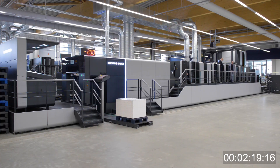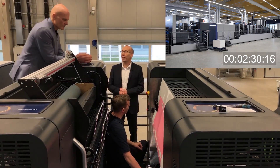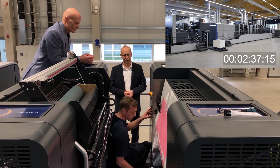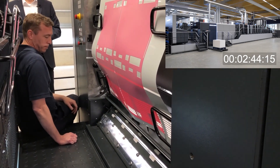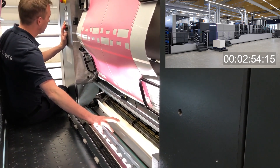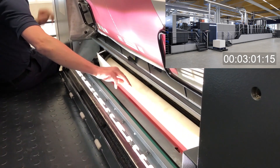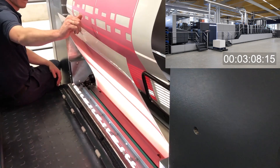Let's see what Björn is doing — he's already walking to the coating tower. You can see how fast our make ready process is. Björn is now changing the coating plate in parallel, because for the next job a spot color plate is needed. The operator only pushes the button and then the coating plate comes out fully automatically. All the positioning and tensioning work is done by the press. Björn has no tools at all in his hand — no tools needed on our coating units, including when changing the Anilox roller.